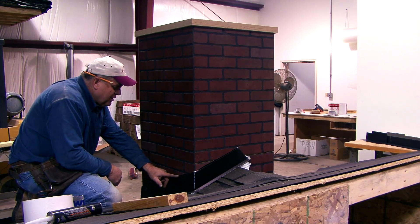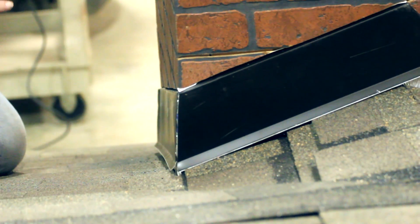We've got to get the water out onto this flashing detail. One thing we like to do on cultured stone, brick, or stone is use a good masonry water repellent or waterproofing spray. We go up above the roof and spray that waterproofing on the cultured stone or brick — it'll help make your brick last longer and also help stop water from weeping through your mortar bed and getting in behind your flashing. That's the end of our second video. I hope it was useful to you, and thanks for taking a look at it.